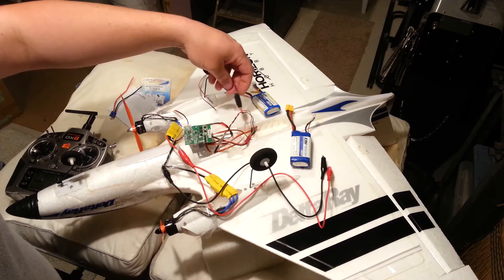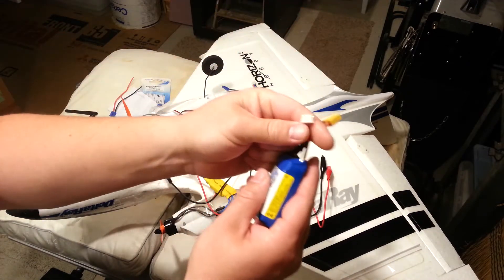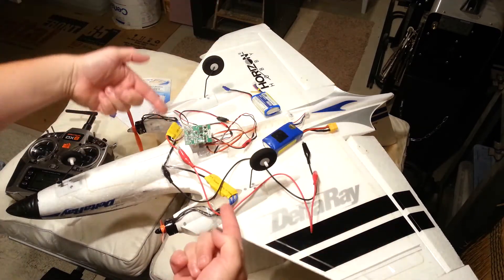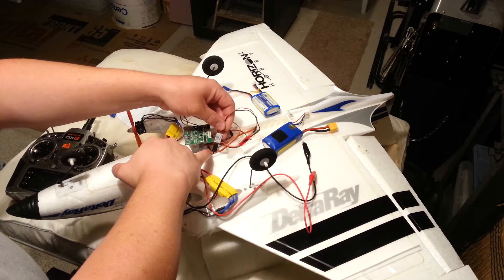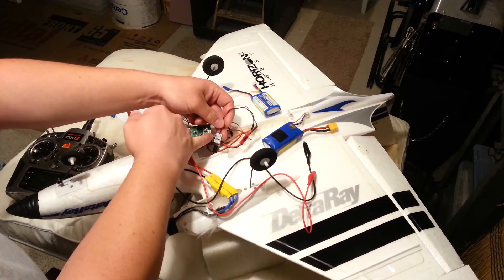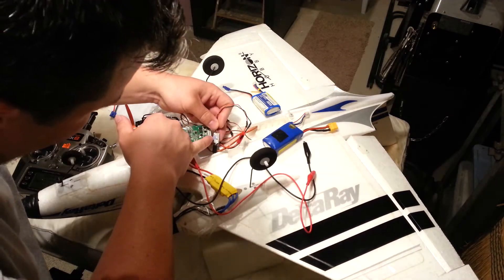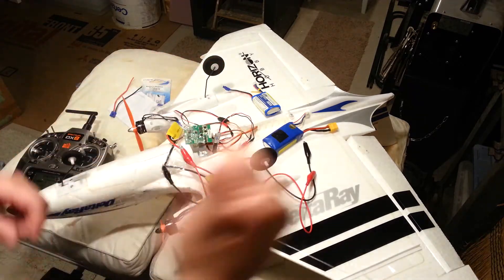What we're going to be doing is stealing some 2S voltage off of a 3S pack by tapping the black and blue wires. We're going to use the main leads — just temporary — to run both ESCs. The signal wire, ground wire, and power wire are going to run these little brushed-to-brushless signal converters by Xtreme — spelled X-T-R-E-M-E. Spelling is not my forte.